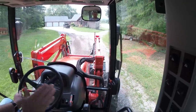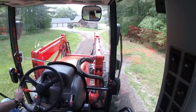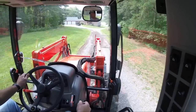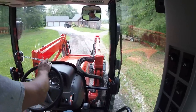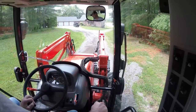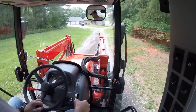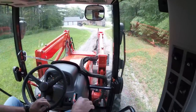Just doing a couple of final drags and packing it down with the tractor. Those ruts were probably at least six inches deep — some real deep ones. But this will cure it again until the next gully washer. Looking at it now, you can't even feel the hump; it's just about filled in without even having to use any new gravel. Now I'm going to get even more angle because there are big ruts coming up here to try and pull more gravel. You can see the ditches are starting to fill in.